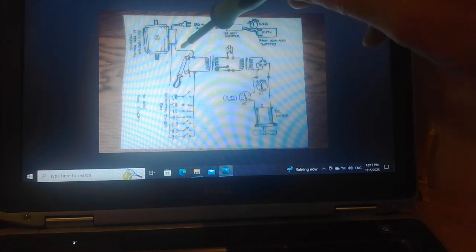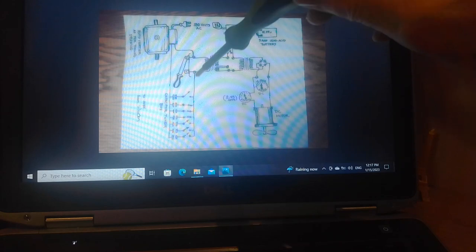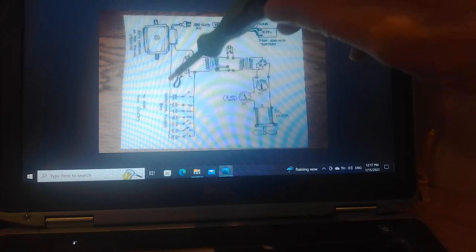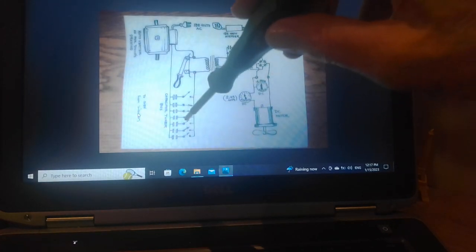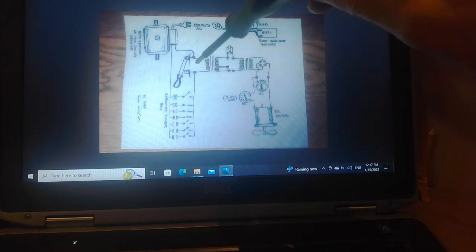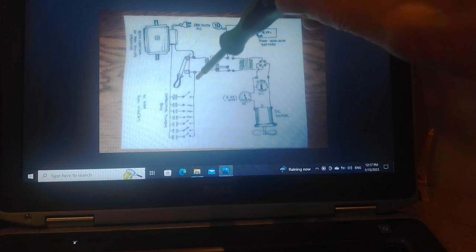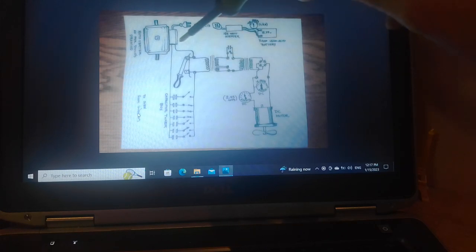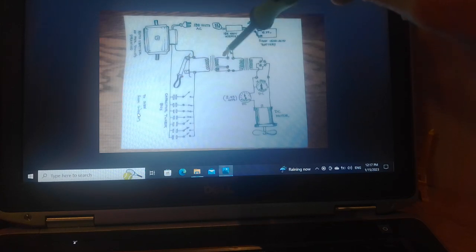Okay, he has a switch here now on this transformer that's in series. Notice it's in series to the L3 line. And this is the L2 line, so he has a cap box here so he can quickly change capacitance. It's really nice to have for testing. But to get it started from stop, you have to have this disconnected. That's why he has a switch here. So here is the transformer in series to L3, and that's going to power this load of a DC motor.